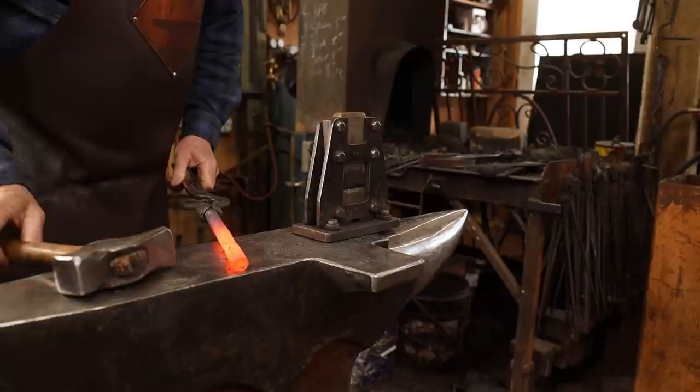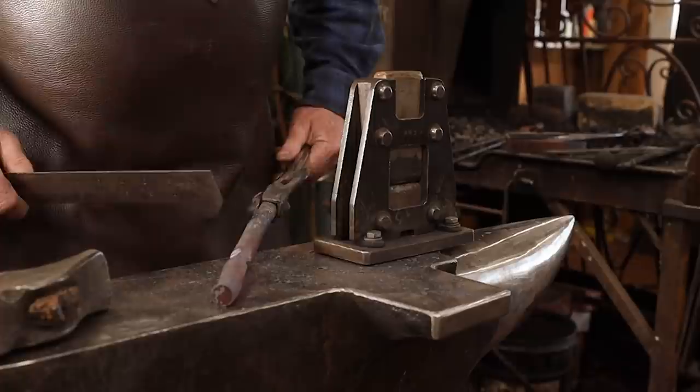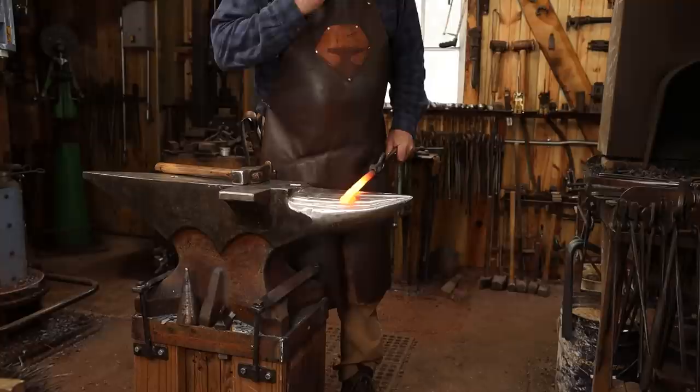The drawing shows the shaft on this being about a half-inch square with heavily beveled corners. And it looks like I've gone just a little bit too far, so maybe this won't be the large one — maybe we'll end up making the next size down. So a slight design change: I need to draw this out about eight inches.